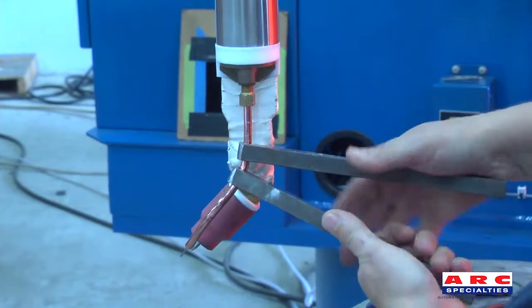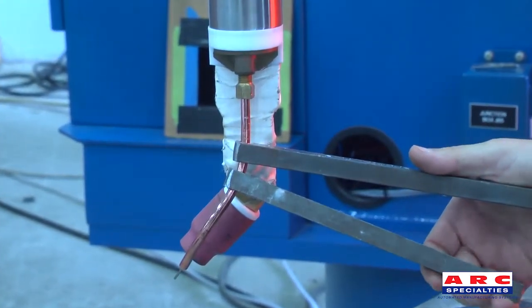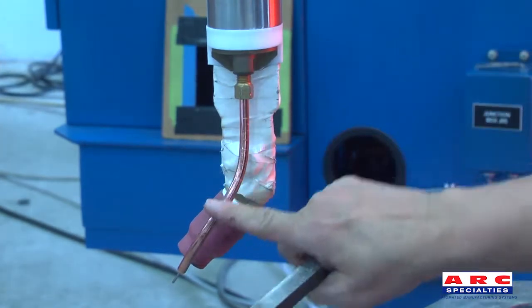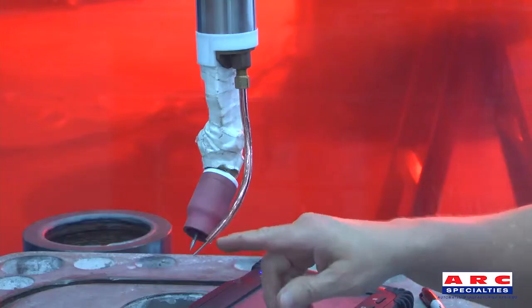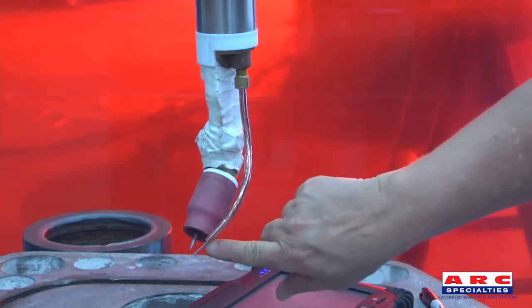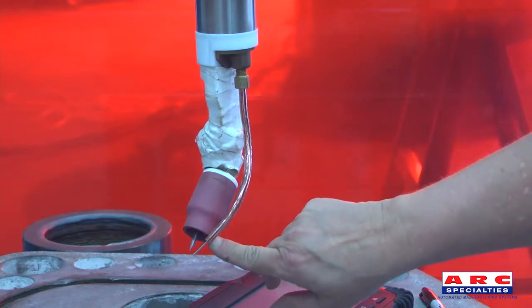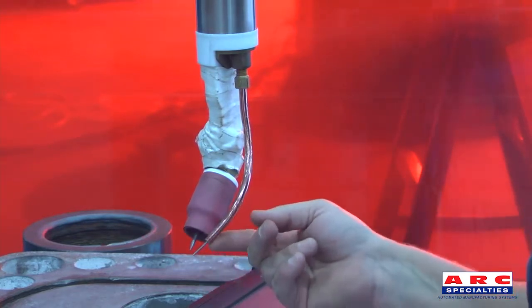If it's necessary to undo a bend, just position the benders around the most bent spot of the guide and squeeze them together ever so slightly. It doesn't take a lot of pressure to undo some of the bend. The wire guide is touching the cup, but it shouldn't be pushing against it with any pressure — it is just there to steady it so that it doesn't move.